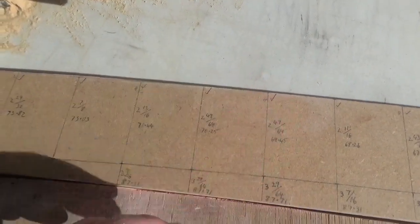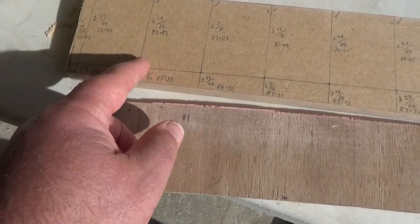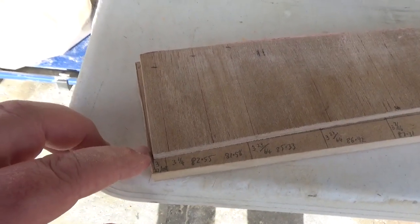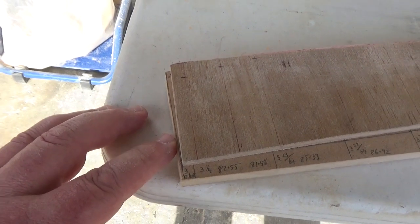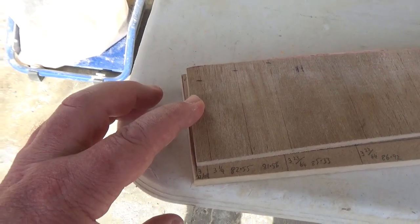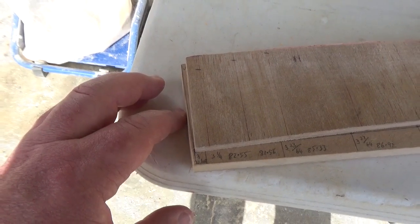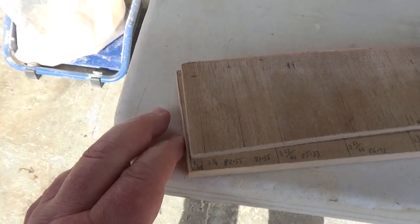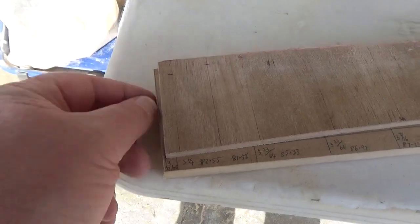The other thing I've learned from doing this exercise is when I made this up, these ends are straight up and down — they're parallel with these lines here. But if I put this on here, this is actually curved out, whereas this is straight up and down. The reason it's curved out is the spars are actually on a lean by two and a half degrees. That's not replicated on my very first attempt, so I'm really glad I had that attempt, recognised the problem, and didn't start cutting up plywood before I had this go. In fact, I didn't spot that problem until I mocked everything up in CAD, and then I spotted I was meant to have a two-and-a-half-degree lean. Up until that point I thought it was just a mistake, but it's obviously dangerous to assume that sort of stuff. So I also need to sand these parts down to the line and double check those dimensions.